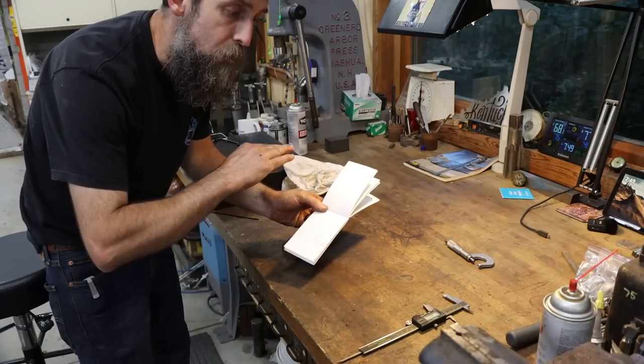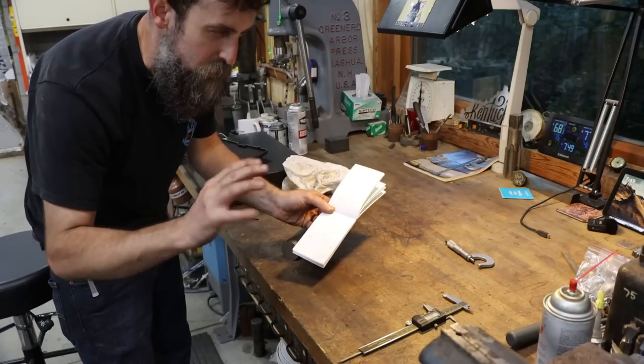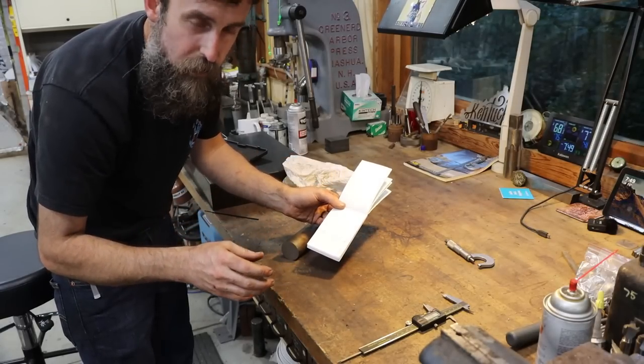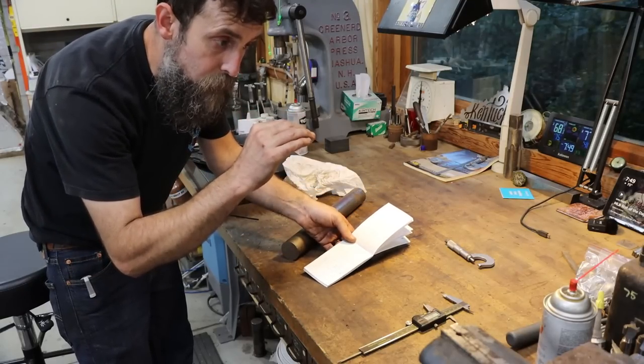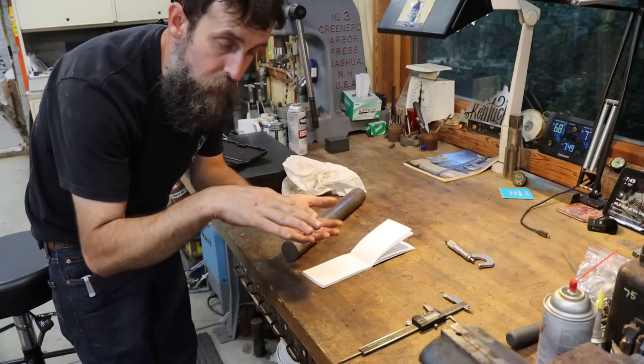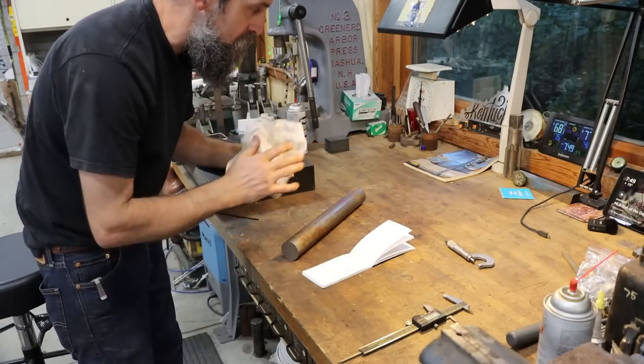It needs to be finished ground on each side to a thickness of 200 thousandths, or about 5 millimeters, I think, within a couple thou. They really just need to be right around 200 thousandths and nice and parallel on each side. I'm not exactly for sure what they're being used for, but there needs to be 8 of them.